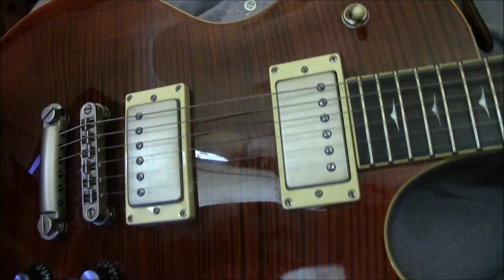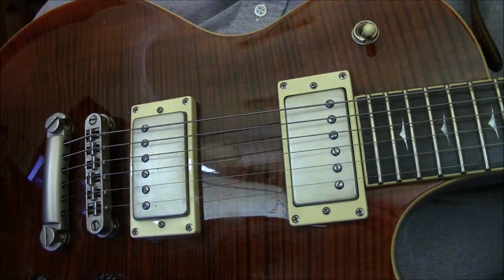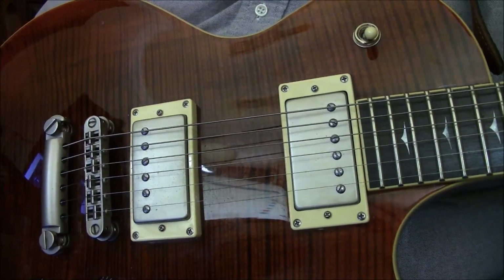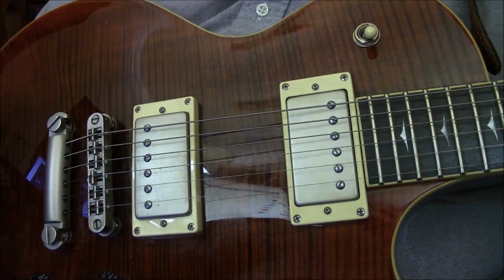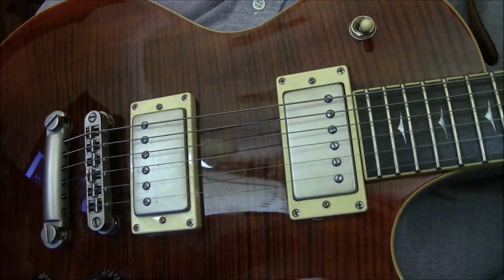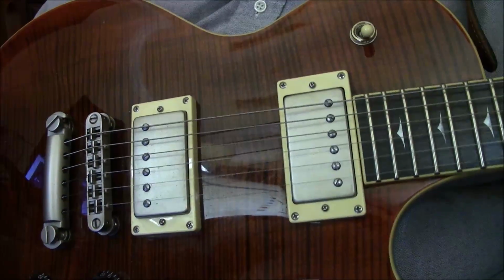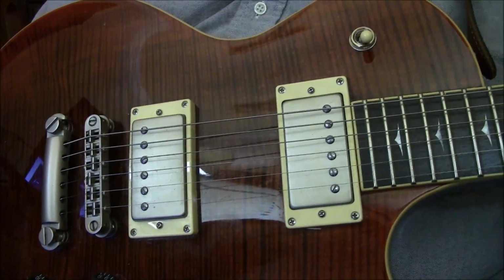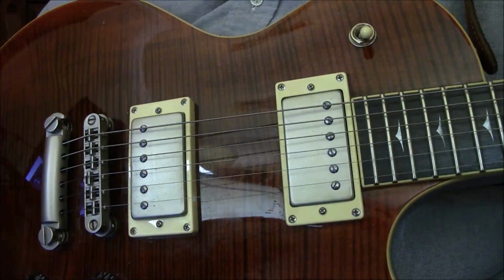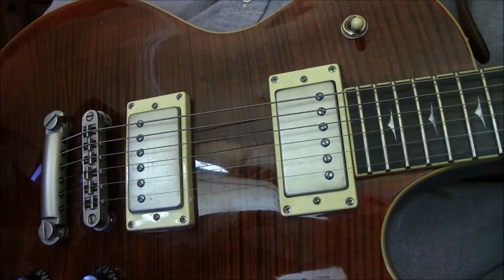Now, in this video, you're going to see the edited time it takes to go ahead and check these amplifiers out, and why it costs money to do this. You're into two or three hours' worth of your bench time to go through and check everything, and it's well worth it. A lot of this video will show you that, from just looking at them, I thought there were new replacement orange drops, so there wouldn't be a problem with them. But it turns out that most of them are shot. Even the new ones. The older ones, the old brown dog turds that are in there, were okay. It's like, wow, figure that out. The older one's good, the new one's gone bad. And another reason why it's being sold, I'm pretty sure.